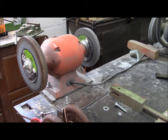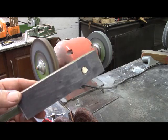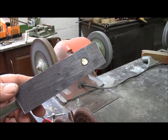When you have a task with many parts, it's a temptation to leave things halfway done until later, but I'm going to go ahead and finish this connecting piece. I didn't have a nut and bolt of suitable length, so I went and got a carriage bolt this morning, but the head is too large, so I'm going to turn the head down so it doesn't protrude beyond the wood. I've ground down the head of that carriage bolt so it fits flush in that countersunk hole.